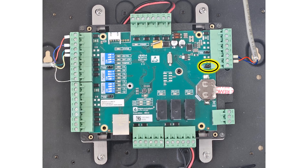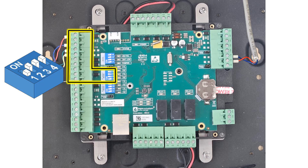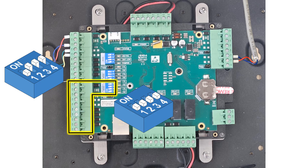Using a star-shaped connection topology is not recommended. Remove the plastic battery tab from under the RTC button cell if this is still in place. The top row of DIP switches must be all set to off for door controller mode. The DIP switches for the reader port should be set to 0111 for OSDP reader mode. If you're only using one reader, leave the second port DIP switches all off — this will save on allocated addresses and minimize unnecessary communication.